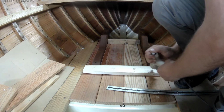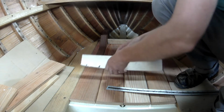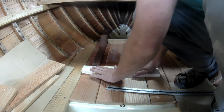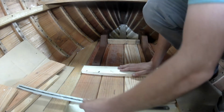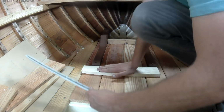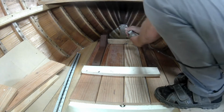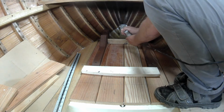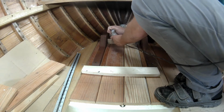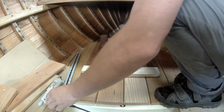This is a little trick that I use to stop things moving. So once you have your floorboards in position, this little trick will keep it in position using a hot glue gun and 2 offcuts of wood, because it's very hard to take these out of the boat, assemble them and make them fit back in the exact way you want, as this little trick will make sure that it will fit back in the exact way you took it out.